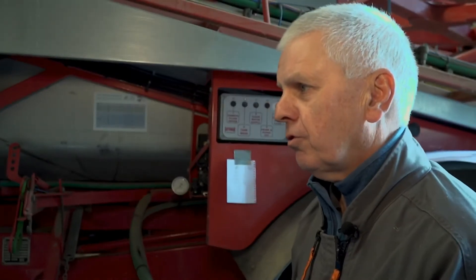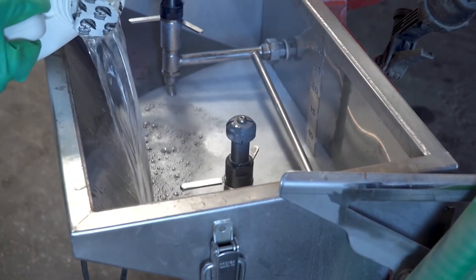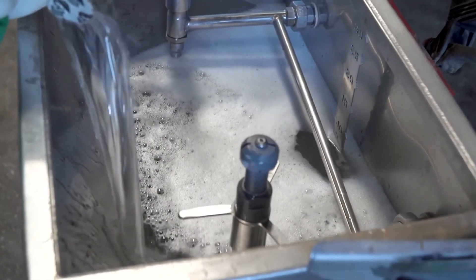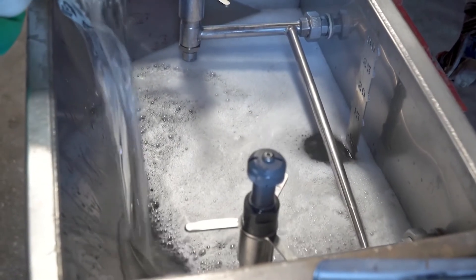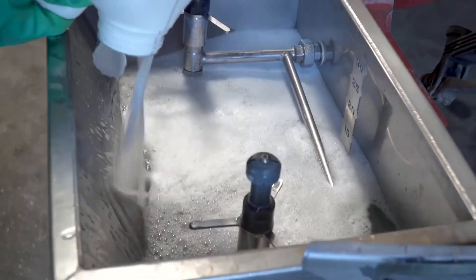What's your recommendation for pouring without splashing? To prevent foaming you don't want any air being taken through the induction hopper, so I usually have the induction bowl about a third full of water. As I pour the cans — it's a bit like an orange juice container indoors — I don't want any glugging, so I hold crop protection products on their side and pour so there's no glugging. I also don't pour into the liquid in the bowl; I pour onto the side where the rinse is taking it in. That reduces any splash, reducing operator exposure and point source contamination.